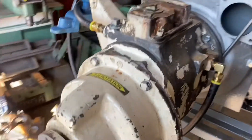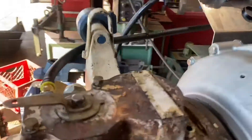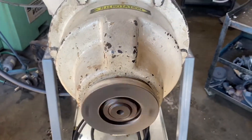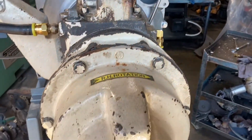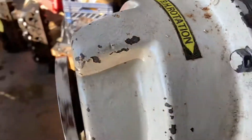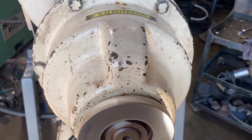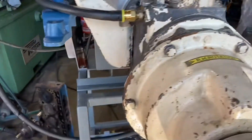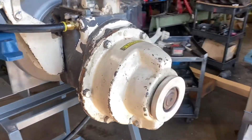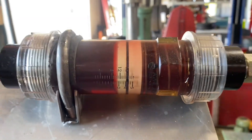Okay, we're testing our P-44R overhaul out of the 1977 Chris-Craft — had the wrong gear set in it. I got maybe about idle speed right here. We got about a gallon per minute flow. Put it back in neutral. A little bit forward — nice and quiet. Beat it up, a little wide open throttle here — it's at 1800 RPM. It's pretty quiet. About four gallons a minute flow at 1800 RPM — that's good.